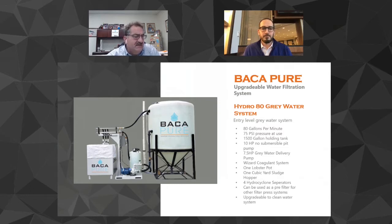Okay. So basically, like I had mentioned, we pride ourselves in building complete filtration systems that are user-friendly and very low maintenance and just keep running. When we start out the system, we go through the floor trench, and we'll show you a little bit later. The first line of defense is a lobster pot that is basically a flume screen. Everybody knows you get chunks of polishing discs, caps off of 5-gallon pails, chunks of stone that are 3/8 of an inch to a 1/4 inch, large pieces that could affect pumps and whatnot. So the first thing we do is strain out all the contaminant that could harm the pump and give you pump failure.